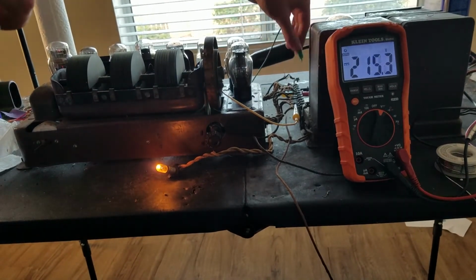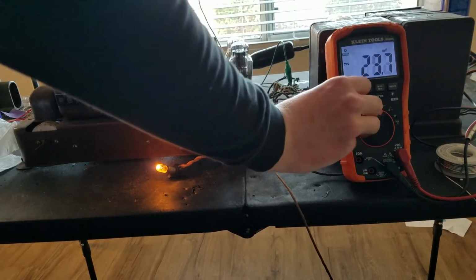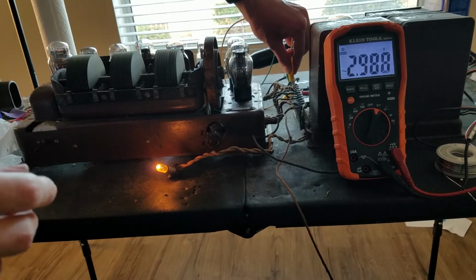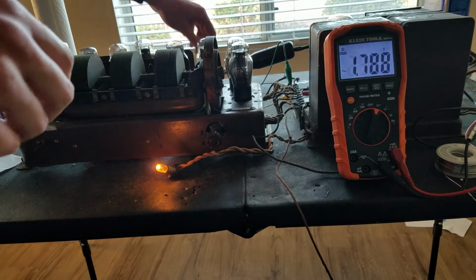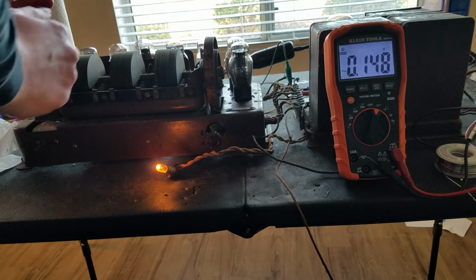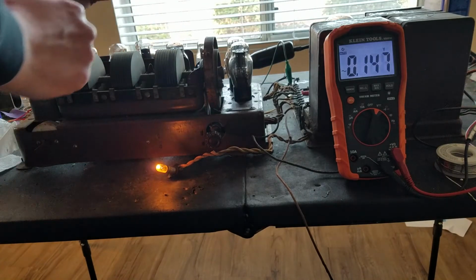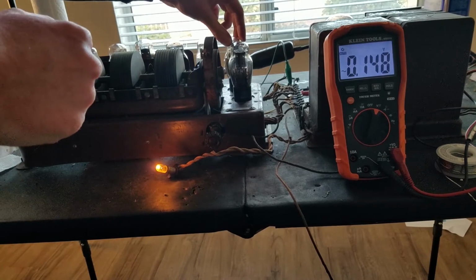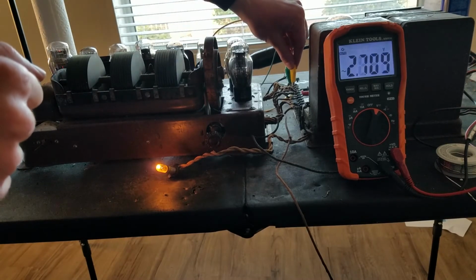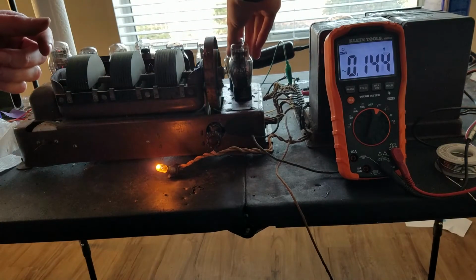Okay, let's check the AC voltage on here. This last two is AC. Have 2.9 volts, so they should be. Not seeing any illumination. These tubes usually do take some time to go off, but I should be seeing something going on. I'm not seeing anything at all. I wonder if there's a break somewhere in that wire. That's 2.9 volts AC. That definitely should be lighting, but I do not see anything.